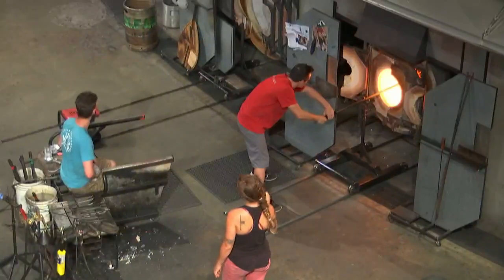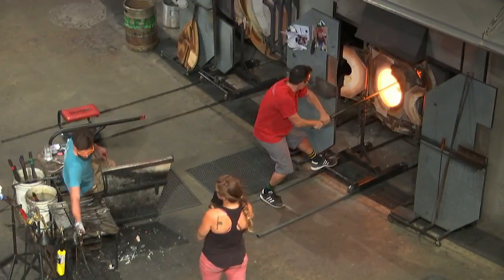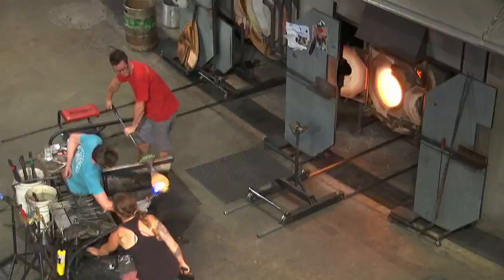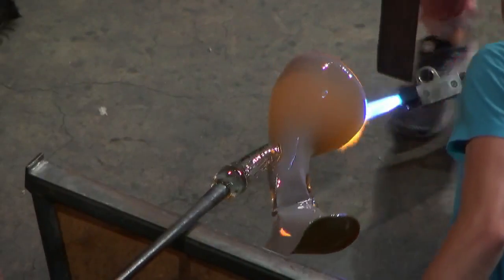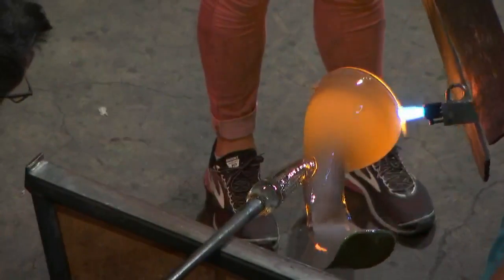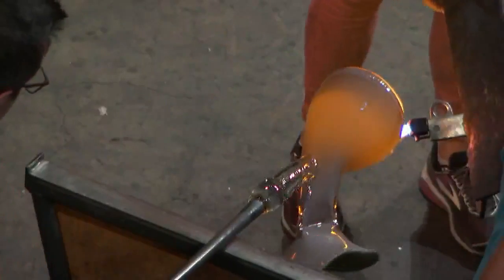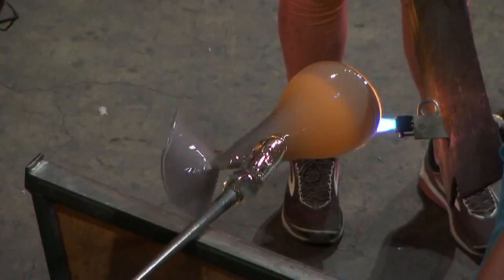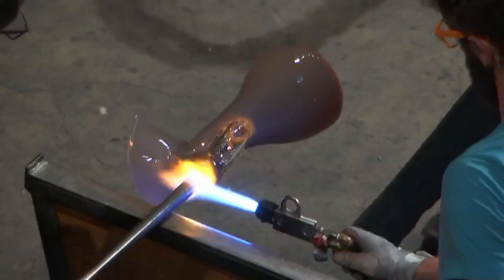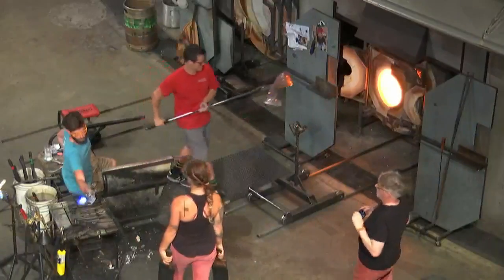It's a heater, so it heats the first thing it strikes. So we put the paddle between the glass and the hand. The paddle gets hot and the hand doesn't. We're heating up the bottom there a little extra so that we can stick the second piece to it. Hot glass sticks to hot glass.